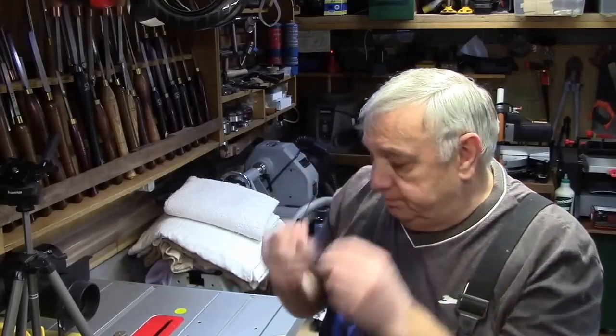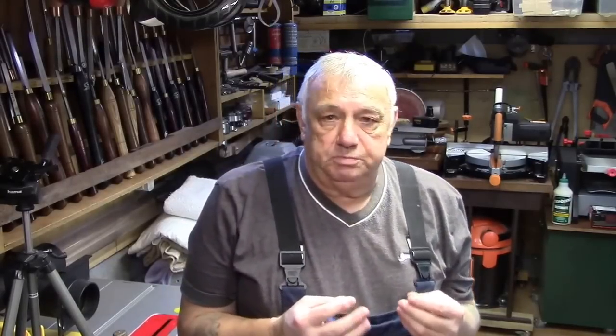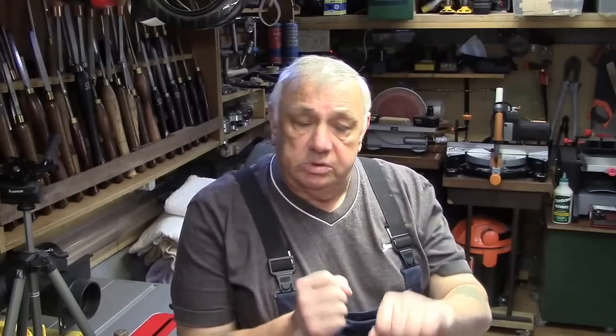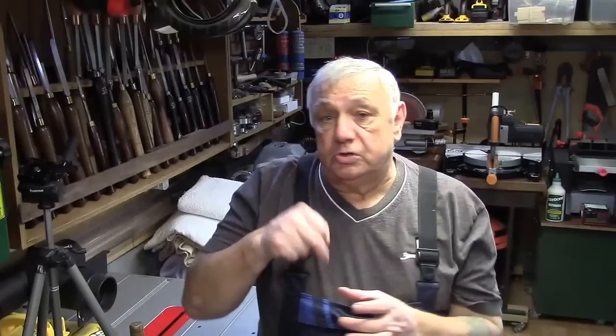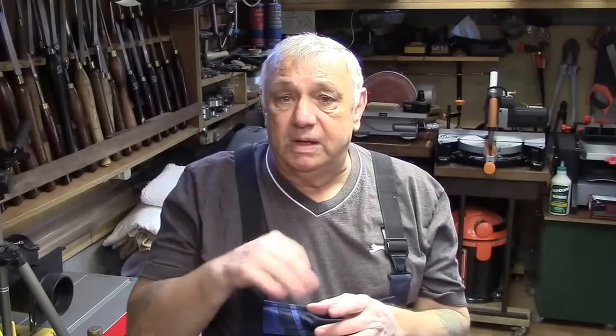And the couple of little snags I had with it was on the inside of the bowl, trying to get it finished with all that spalting. The wood was so piffy. I got it in the end with a little half inch round nose scraper, just turned it over into shear scraping mode, and just worked away at it until I got it right. And the same on the scroll saw. When I had the pattern on the scroll saw, the blade wanted to dance into the softwood rather than staying on the line of the pattern, so I had to do a little bit of sanding there. All in all, it's not bad. What I'll do is I'll put a couple of stills up at the end and let you have a look.